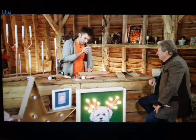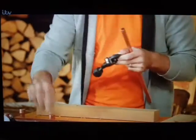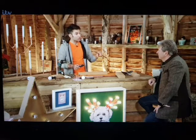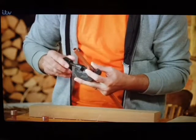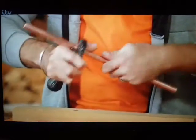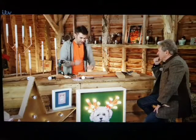The copper is a little bit too long, so we're going to cut it down using a pipe cutter. These are about six quid and they're adjustable, so you can use both thicknesses, any size you like. You can also use this for curtain tracks, poles, or if you want to add an extra rail in your wardrobe. So put that on, tighten it up a little bit, get it into position, tighten it just so it's a little bit tight, then turn — it scores it. Turn again and it gets tighter and tighter. You could use a hacksaw, but this is just the simplest way. Look at that — no sharp bits, not jagged.